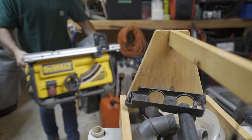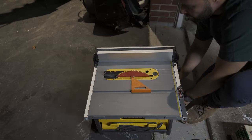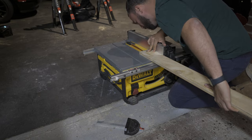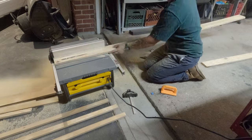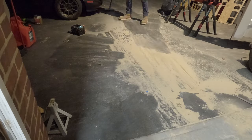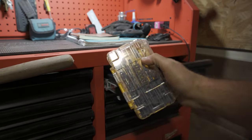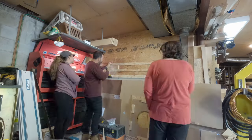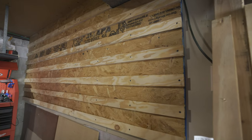With that out of the way, it was time to cut the cleats for the French cleat wall. I put the table saw on a 45-degree angle and ripped all the pieces down the center — giving me two cleats per piece. Hopefully this was the last project I had to use this table saw on the ground, because I've designed a whole workbench in Fusion to integrate the table saw into, which I plan to build in my next video. To mount the cleat portion to the wall, I pre-drilled through all the cleats and screwed them up at equal spacing. The spacing between each wall-mounted cleat must be at least wide enough to fit the inverse portion of the cleat between them, or the concept won't work.